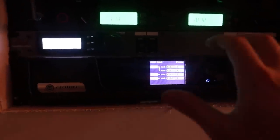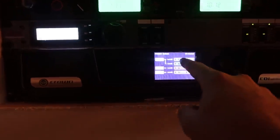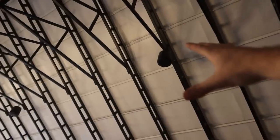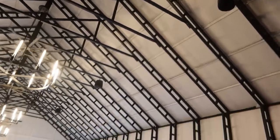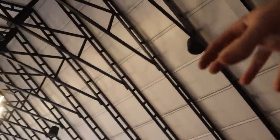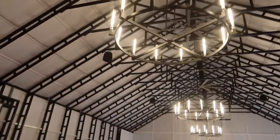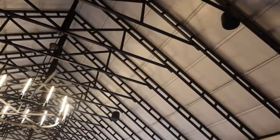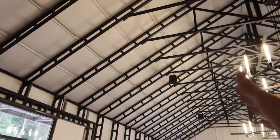I can basically tune and control all of the parameters for the switches and the different zone outputs — everything is controlled through this unit. It's a powerhouse. All of the speakers except for the subwoofer are being powered by the Crown CDI 4x300. You can kind of see a readout of all four zones. In the main room there are six speakers — the JBL Control 67HC — designed for high ceiling and high reverberation applications, which is this room entirely. It's concrete floors and it echoes like crazy. But because we're using pendant speakers firing straight down with a narrow coverage pattern, all six provide amazing sound — probably the best you could put into this venue. The amp is actually using two of its four channel outputs to power these six main speakers.